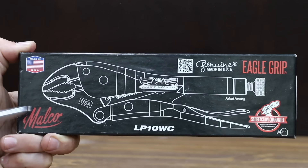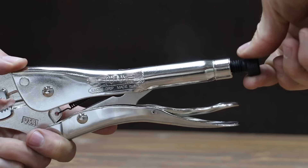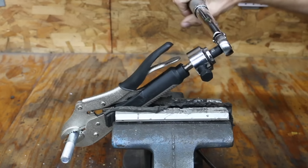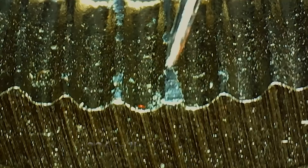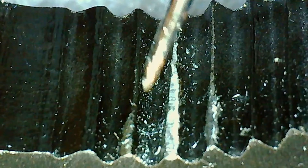The Malco calls their locking pliers the Eagle Grips, and it definitely seems to be a great description. In the first test, I clamped the locking pliers onto a smooth portion of a grade 5 bolt. I then used a rounded nut extractor fastened to the tension screw, and the adjustment screws were tightened to 120 inch pounds. Unfortunately, not all the brands could handle 120 inch pounds of torque on the tension screw. The teeth on other locking pliers were just not very sharp and were too soft to gain a good grip. Even brands that performed well experienced a lot of wear and tear to the teeth.